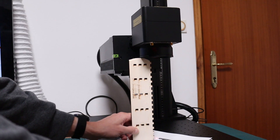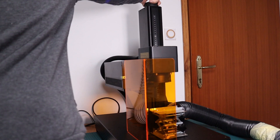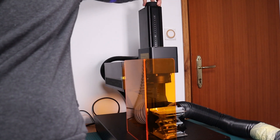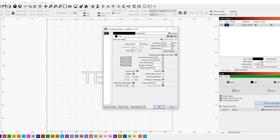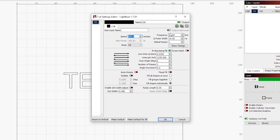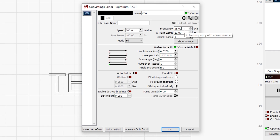I made this easier by creating a simple focus stick that I used to measure the distance. It's in focus when the two red dots align, or you can measure the correct distance with a ruler. When the machine is perfectly focused, the engraving noise is loudest when using a powerful setting. UV lasers don't have a traditional power setting — engraving power is controlled by the frequency and the Q-pulse parameter. The smaller the Q-pulse, the stronger the engraving effect, and with a higher frequency, more pulses are emitted within a given time.